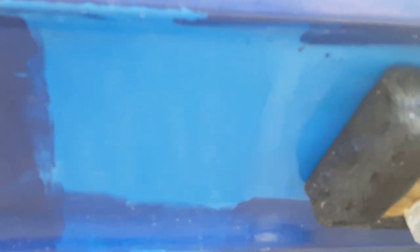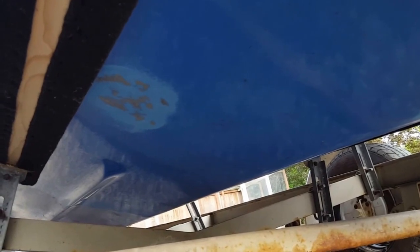On the other side of the boat you can see up under it — I painted everything up here well. There's another scuff from me running into the dock too hard. The gel coat was all faded so I stripped it, but way up under the bottom the gel coat is in very good shape. There was a little scuff in the back — looked like it had been run up on some rocks, not through the fiberglass but scratched — so I refiberglassed that area, sanded it down smooth, just to make it last longer.